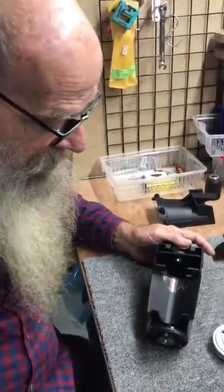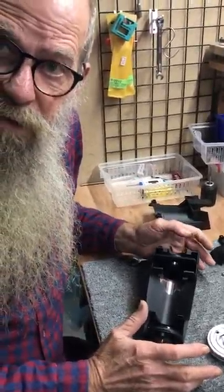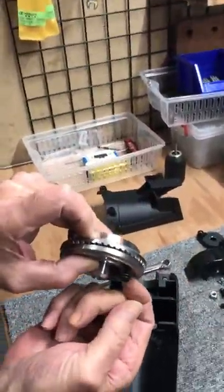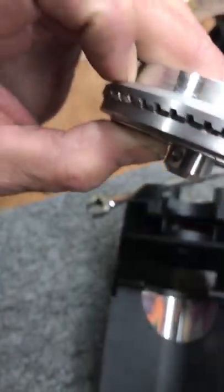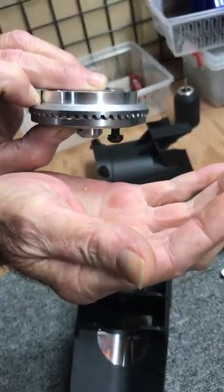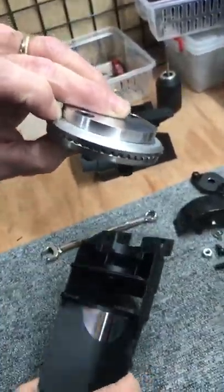Joanne's still on. So now I'm going to show you how to put the grinder together, including the alignment situation, okay? I've got the burr out. I've done everything they want to do. You want to make sure your lock washer is down against the head. The lock washer goes on. The lock washer is in a cupped shape, so the cup is in this direction, okay? Cup this way.